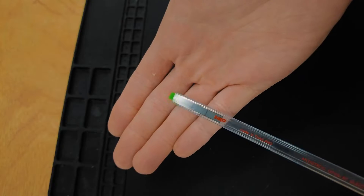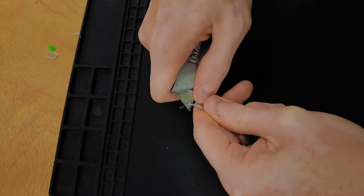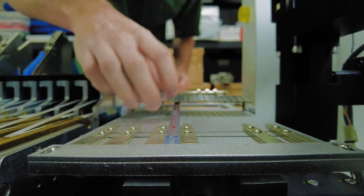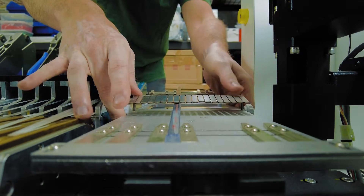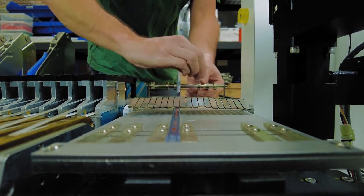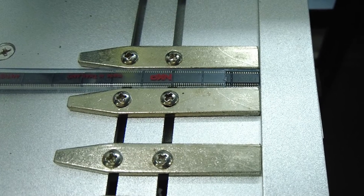Reels are very high density and feed automatically - very low fuss. These ICs however came from the supplier in tubes. Tubes are okay, they're very versatile, you can get a lot done with tubes, but super fiddly. If you can avoid using tube, absolutely do. This special vibration feeder that you mount the tube in vibrates and jostles the components forward. They're very fiddly to set up, require frequent intervention to refill, and they're kind of noisy. But you can get a lot done with tube that you can't get done with reel.